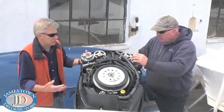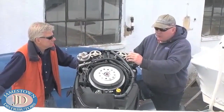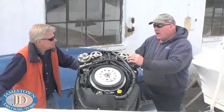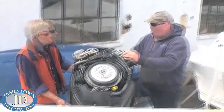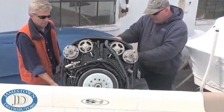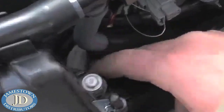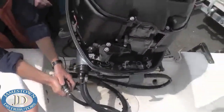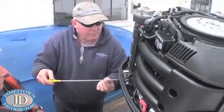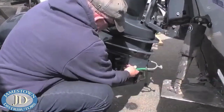After the visual inspection, we're going to lift up the engine, make sure that the power trim is working, set the engine back down, then apply water to it and crank the engine over. Steve reconnected the lead to the fuel pump — he disconnects it at the end of each season so the pump won't run if the engine is accidentally started before the fuel system is primed. Next, we squeezed the priming bulb to force fresh gas into the fuel system. When the bulb was hard, the system was primed. A quick check on the oil level, then it was time to attach earmuffs for supplying water to the lower unit and a hose to the upper cooling water port.